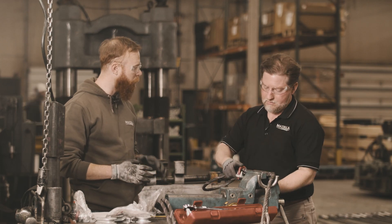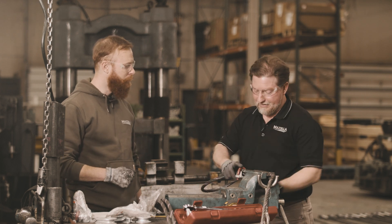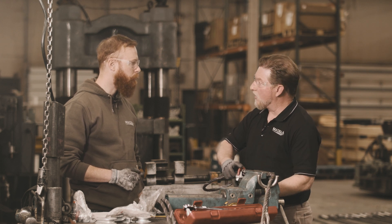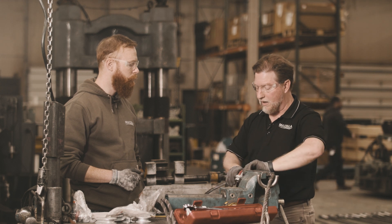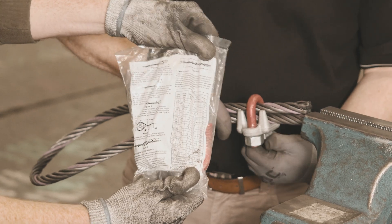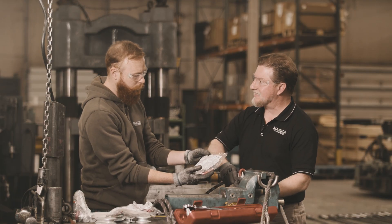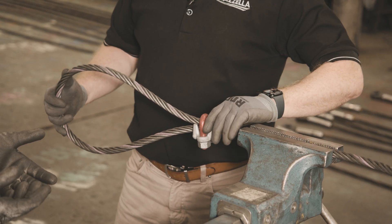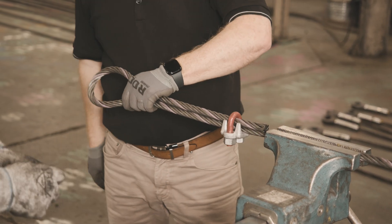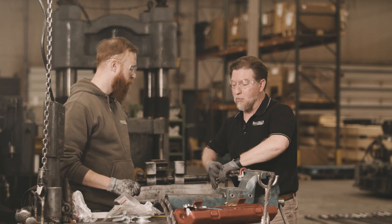How do you know the minimum turn back length? A key vendor, the Crosby Group, is the one manufacturer actually publishing all of that proper information on every single one of their clips. Every clip is bagged and tagged with pertinent information explaining the do's and don'ts of drop-forged and fist grip clips. To start, get things hand-tight beginning at the very end, then move closer to the front where you'd position a thimble. Here we're dropping in a heavy-duty thimble.